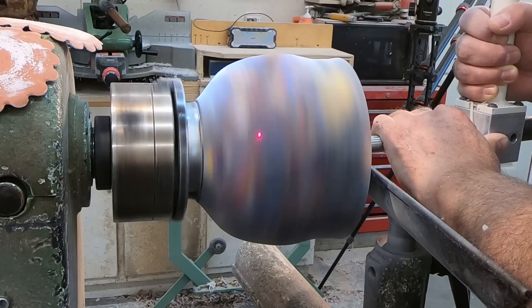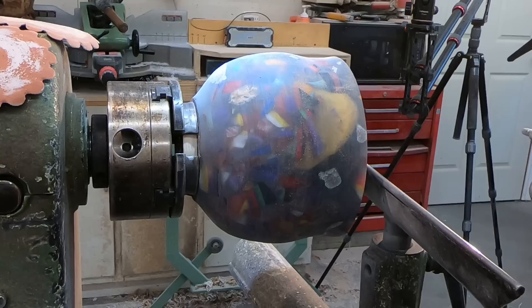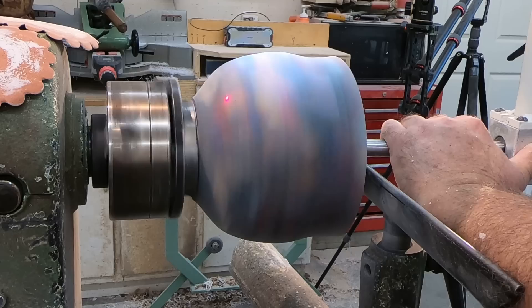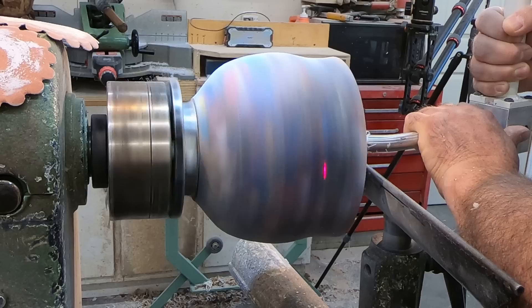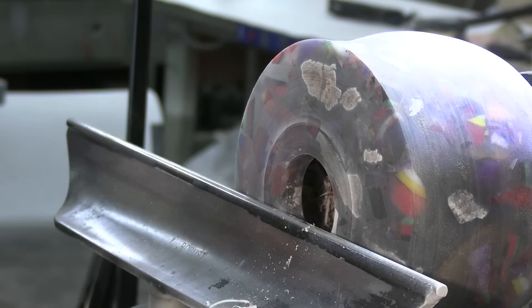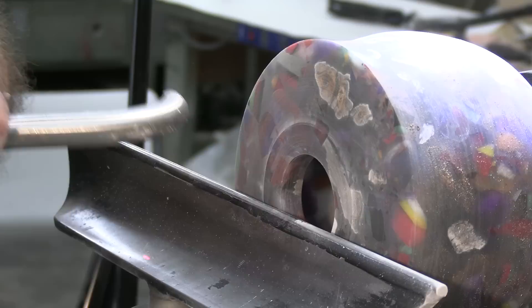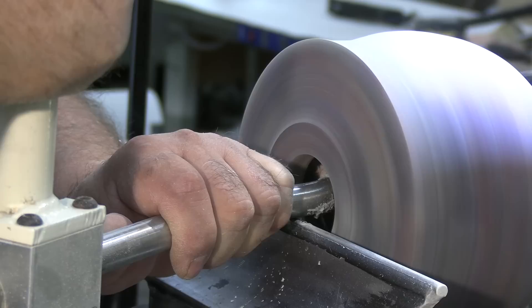For apple and beech, I would let them sit in my drying shed for six months to a year before putting them through my fridge kiln, hoping most of the moisture would be gone and there would be less movement. Those are probably the two most difficult woods I personally work with. Walnut can be on that level as well — it's quite hard, and the other issue is it can be quite aggressive on your lungs. If you have breathing issues, you should probably stay away from walnut.